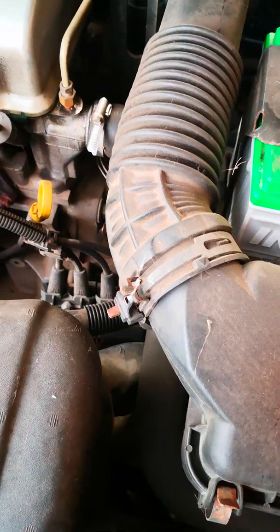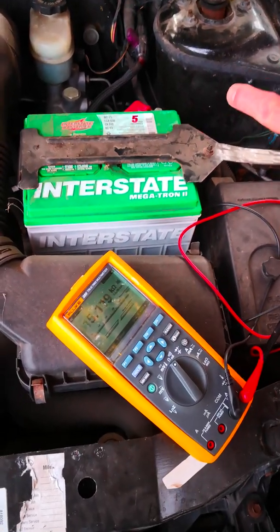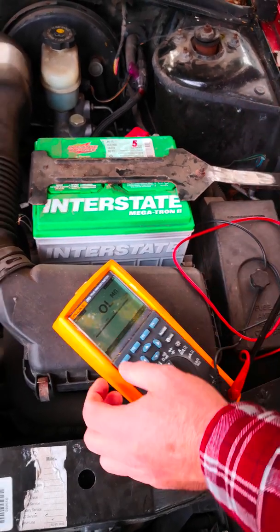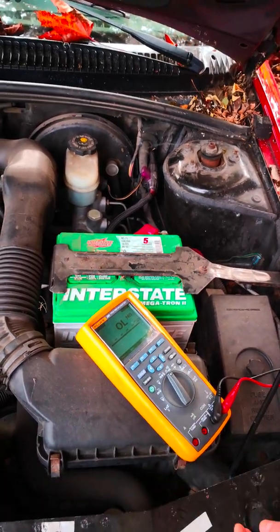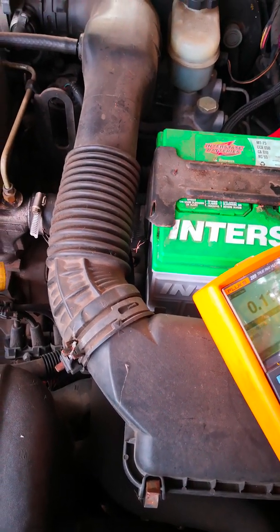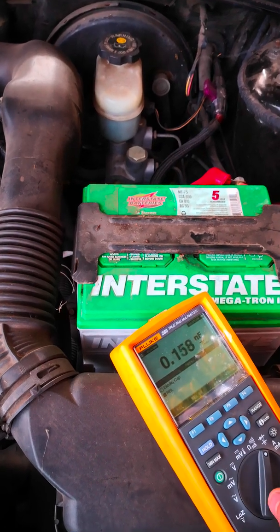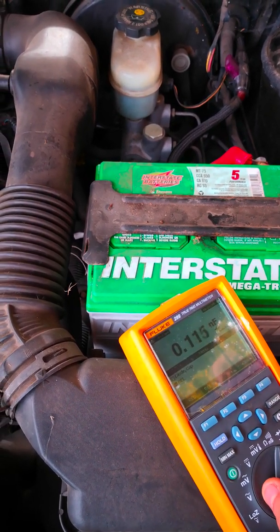This is much more complicated than whatever meter you're probably going to get, because we just looked it up and this is still a $580 meter. I don't pull this one out very much because I usually don't need the extra digit of accuracy it gives, and I don't want to break it. That's for diodes. You're in capacitors. So with this setting that Caden set it to, you can hook it up to a capacitor and it'll charge it through the leads and tell you how many farads, nanofarads, microfarads, the capacity of the capacitor, which you can check against its specifications and see if it meets it.